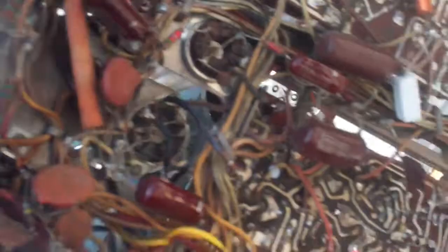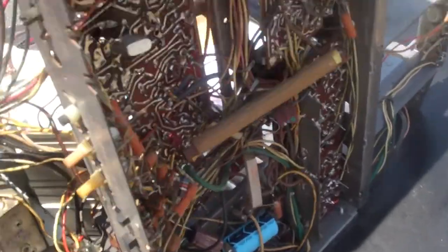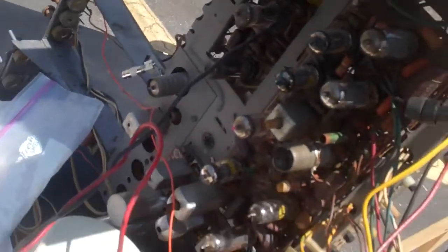There's only that one cap and the three cans. It took me about 30 seconds to diagnose it and two minutes to put the new cap in. Now let's put it back in. About this shaft that pulled out of the volume/power switch — I'm almost tempted to just bypass that power switch to save a service call. The power switch has been bypassed — this is not the time or place to try micro-surgery in this parking lot.